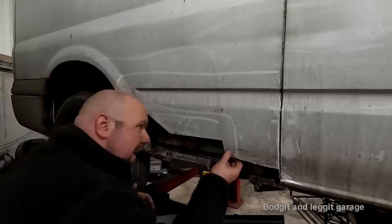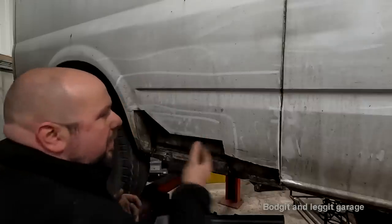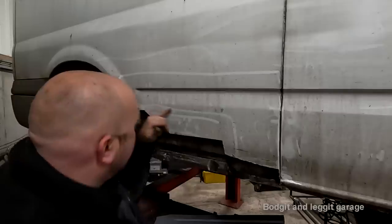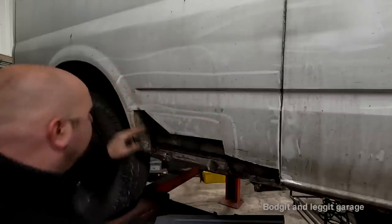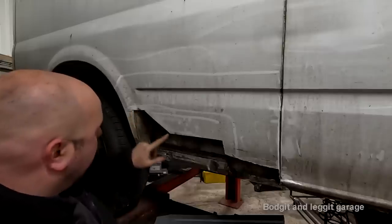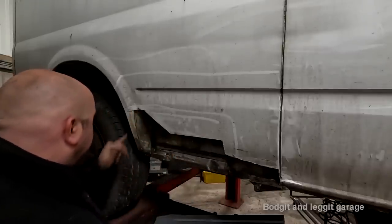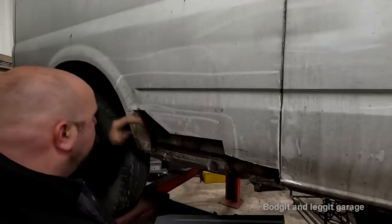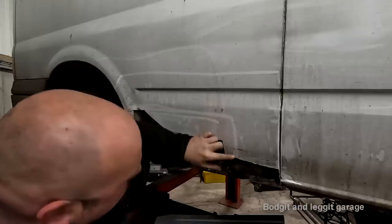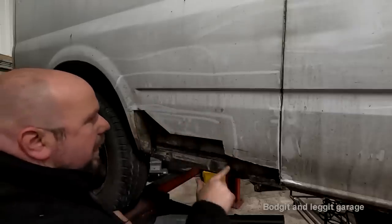Anyway, I haven't decided exactly what I'm going to do yet. I've still got to see, can I step this out? Is this too thick for my stepper? If I can't step this out, then maybe I'm not necessarily going to do the lap joint. But I've got to work out exactly how much I'm going to keep. If it was a butt joint, I don't mind having all these different angles. It's not really a problem. But with a lap joint, it's normally easier to have one line and then, say, a 90 degree angle there, whatever the case may be. It's just normally easier to do it that way and weld it.